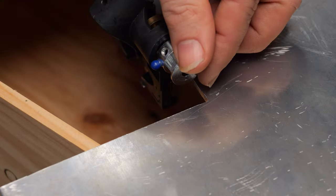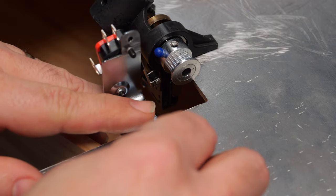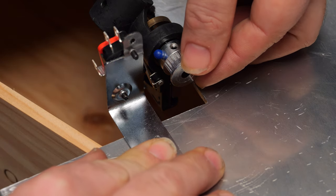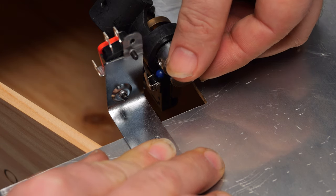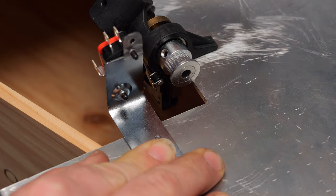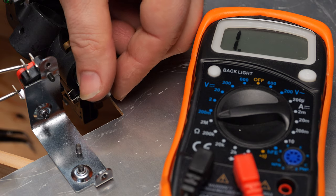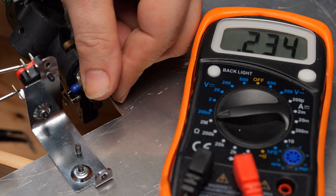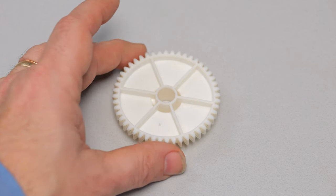So there's the pulley, and I figured out the placement by rotating the gate — when the pin is in a position to strike the momentary contact switch, the film will be registered in the gate with the registration pin and it won't be moving, so the picture is snapped, then the next frame is pulled into the gate. Now I've got to mount this bracket which is holding the momentary contact switch. It's now mounted, and as you can see I put a meter on it — when I rotate the timing pulley it hits the switch and creates a contact. That works.